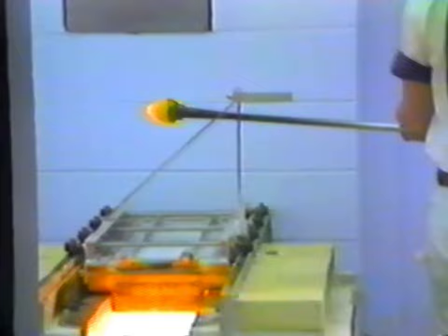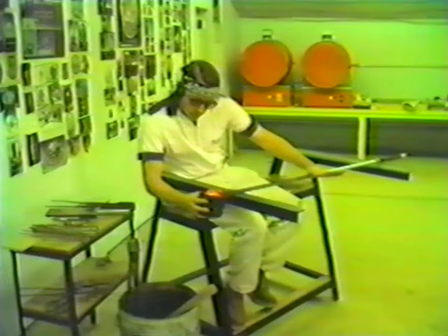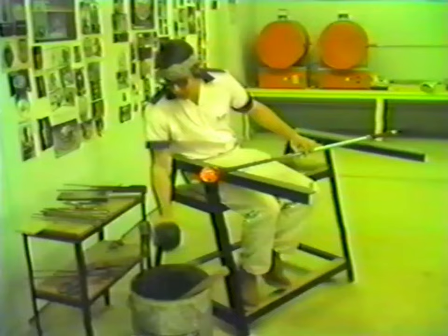What can you tell me about your tools? The furnaces and the bench that you've made yourself — it's a piece of art in itself. There's been very little change in the design of the tools, but a lot of updating as far as materials. With furnaces, we're using materials that were a result of NASA and space age technology. But primarily, the hand tools have remained unchanged for centuries. Mostly they're wooden and metal tools. I use cherry primarily — there's a good deal of wild cherry that grows in the area. The metal tools are manufactured; some I make myself, some I order from West Virginia, England, Germany, or wherever that specific tool is available.